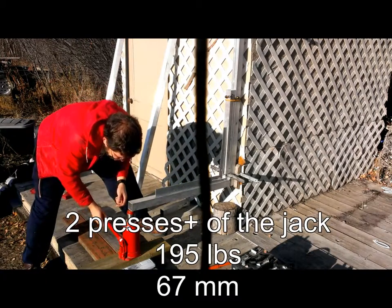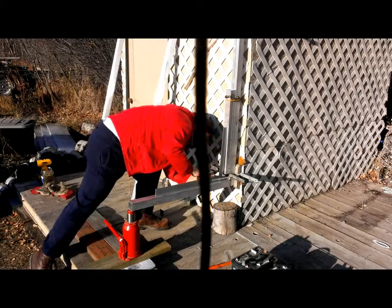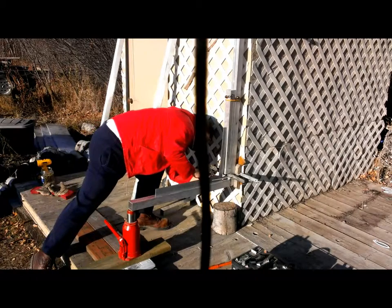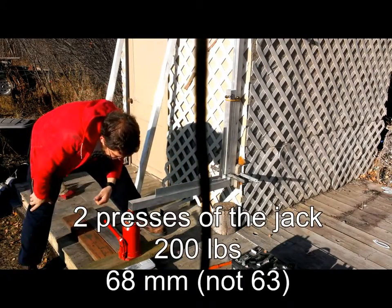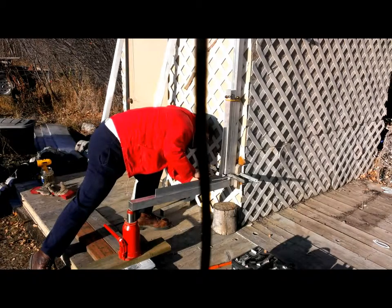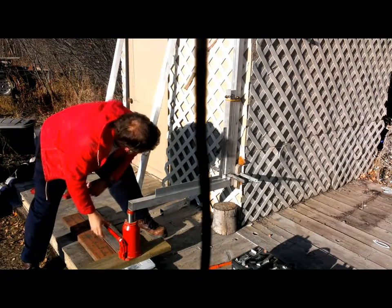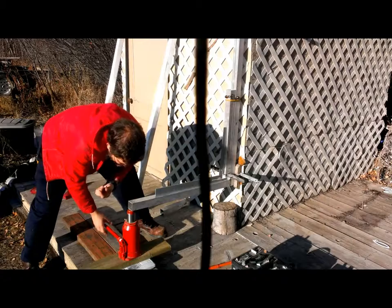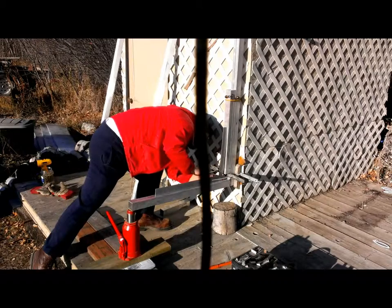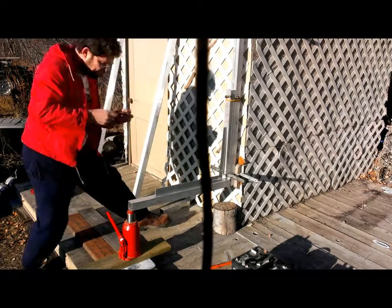And in just that short time, we dropped a pound. So, 200 pounds. 200 pounds. Let's move her to 63. I would say we're at 63. We dropped to 198. I'm going to push it back to 200. And we are more than 63 millimeters right now. I would say that we are noticeably going over the knee of the curve. Second time I pumped it up, that was only a pound. And I'd say 68 millimeters, we are over that.